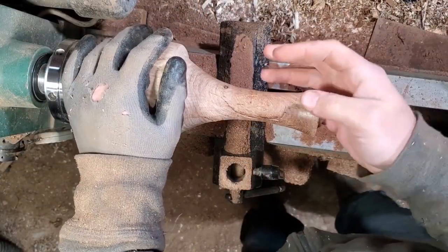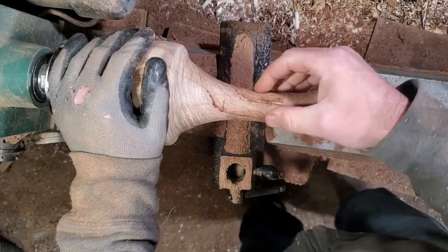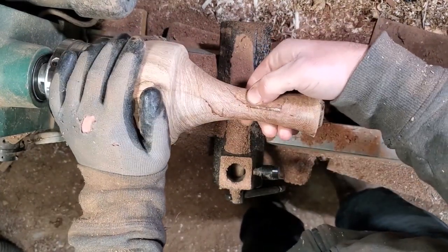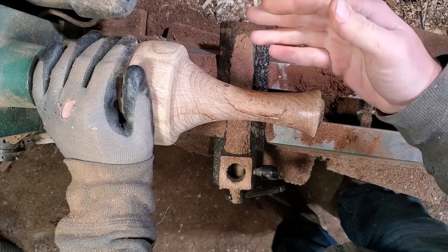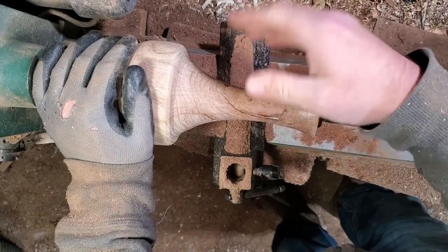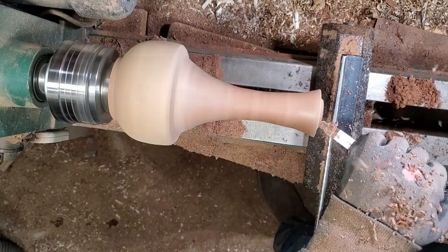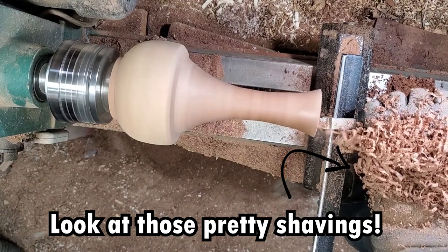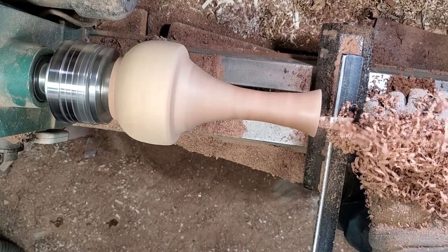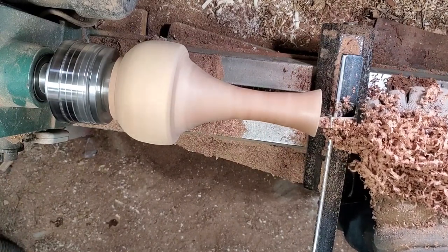While I was drilling, I saw dust coming out of here like there was a poof coming out — it's like I've got a strip over top of a core. I don't want to put super glue and epoxy on the outside where it'll stain, so I'm going to hollow this out just a little bit — take about a quarter inch off the inside diameter — then coat the inside with five-minute epoxy at least down at the bottom. Hopefully it'll strengthen up the inside without having to see it on the outside.